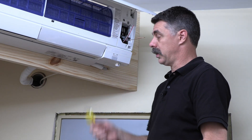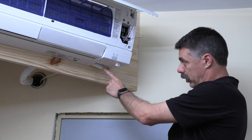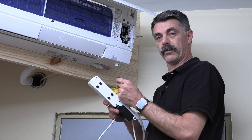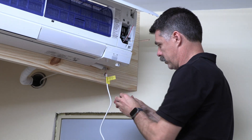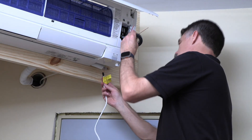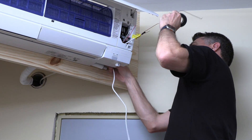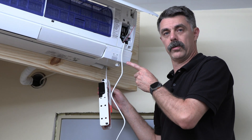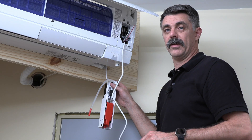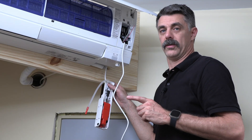Let's start with pulling the wire up in place. What I've done is I've pushed a piece of copper wire down through the unit. We're going to put a hook in the bottom of it, tie it onto these wires, and pull that back up and through using the wire and a little bit of electrical tape. Now that I've got the cable pulled all the way through, I'm going to let this pump hang on this cable — it's a pretty strong cable, the pump is not very heavy — and this is really useful as a third hand while we're lining all the holes up, getting them marked, drilled, and the screws put in.